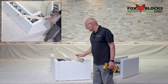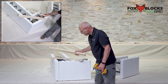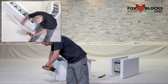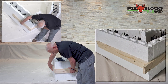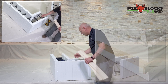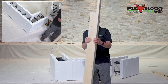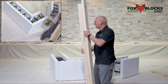There are two things you need to do for bracing. Use a 1x4 — or if you've got money, use OSB. Put one here, screw it onto the straps, put another one on this side and extend it past and screw through into this piece of wood on the other side. That's going to button up the outside. For the inside it's really easy.